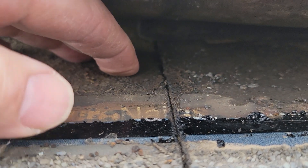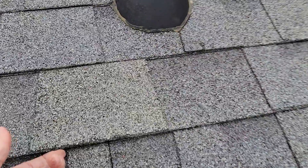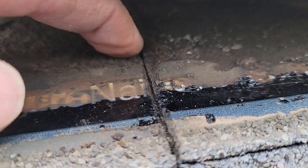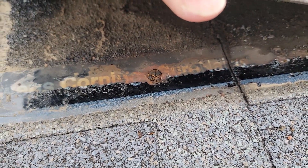If left unaddressed too much longer, if it's not already, you've probably got rotten wood in the area and will have a bigger repair bill. What I'm going to do real quick for these people is shove a piece of flashing up under there to try to divert that water and get it to go a little further. Caulking's not going to stick because it's so dirty, nasty, and wet. It looks like it's an older discontinued self-sealing caulking shingle.